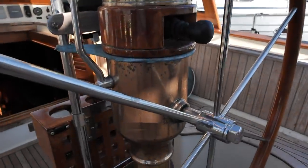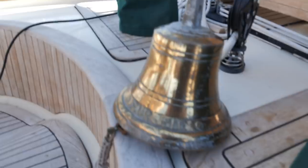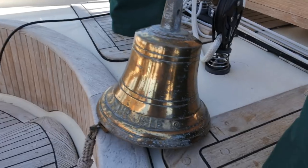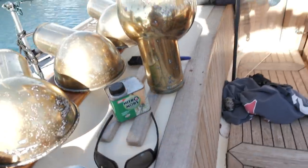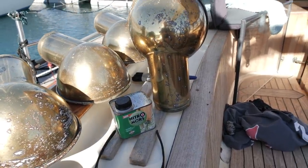If you see the brass cleaning video, you'll see I found a quick way of cleaning brass. I do cheat with some of it and lacquer it. Things like the binnacle were lacquered with a spray lacquer, but last year I switched to a brush-on lacquer and did the dorades and the bell. As you can see, they haven't come through very well at all — I thought it would be better than spray-on, but it's not. So I'm going to clean it all off with a bit of Nitromors and some scrubbing, and then look for another way of lacquering them.